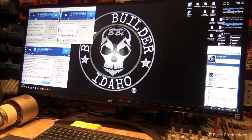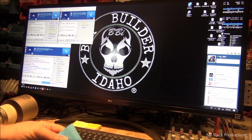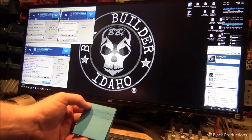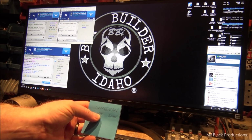Well, I don't know, man. When you go to spec out an amplifier and you want to use all top-line, top-notch, off-the-shelf, brand new components, I mean, you're talking not $3,000 worth of parts, but like $6,000 worth of parts. I'm sorry. I will spend a little bit more money, and I'm going to get myself a tap for 3,500 volts. So I'm going to have a tap at 3,500, 4,200, and 5,600 on the secondary side.